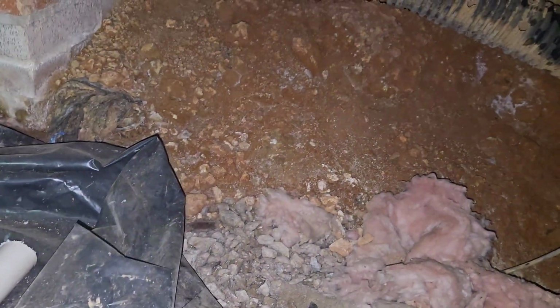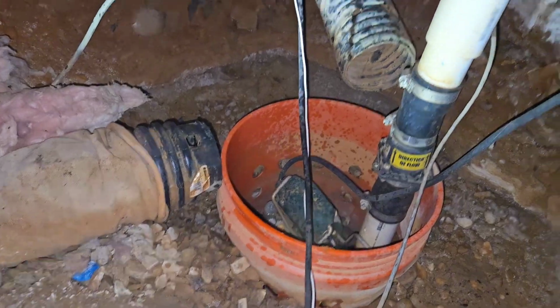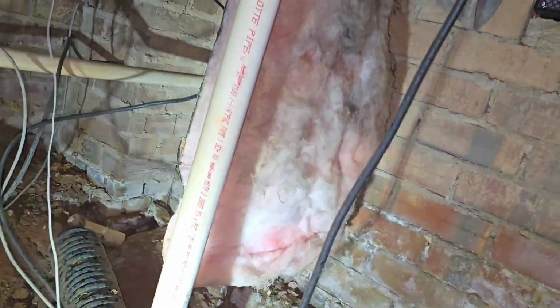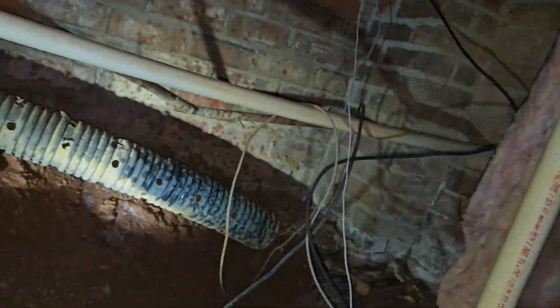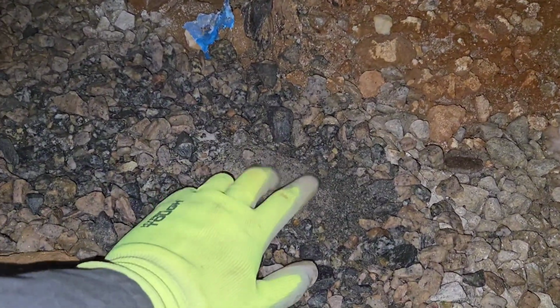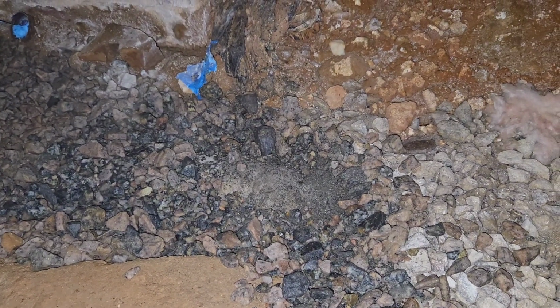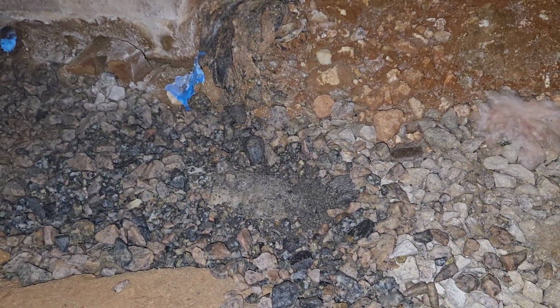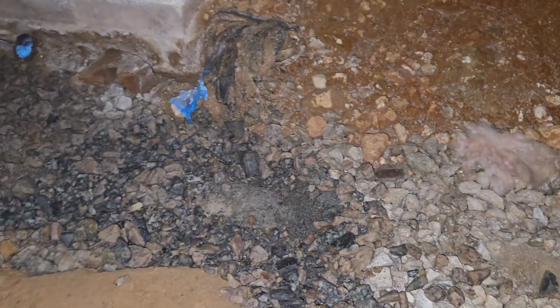And the hardest part about French drains, the material's one thing, but when companies price out these French drains, they price out obviously the electrical, but it's labor. God, to trench. They went down about 5 inches maybe on this one. The minimum standard on a French drain should be about 8 inches to a foot deep. 8 inches, that's great, depending on gravity.